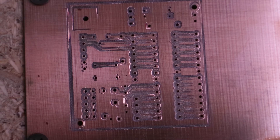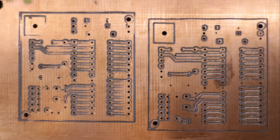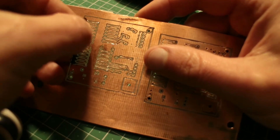And here is the result. It's not great — the surface underneath the PCB isn't very flat and the mechanics of the CNC aren't superb either. I also tried a cone-shaped PCB router bit and it worked a lot better. The depth here is around 0.3–0.4 mm, but I had only a 0.6 mm router bit and it was oversized — for this toolpath I should have used a 0.4 mm router bit. The accuracy of the drilled holes is okay; you can see I have no problem inserting a long PCB header.